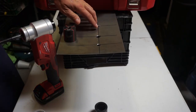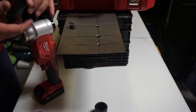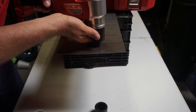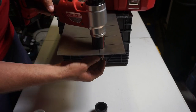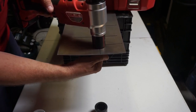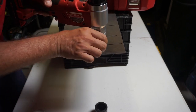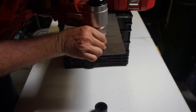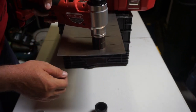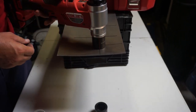I've got my metal already prepped and laid out, with some pilot holes already drilled out up to the half inch — just to show you guys how quick and easy this is. Come in here, screw the die on, line up your lines on the sleeve. They did an excellent job of making them pretty pronounced so you can square up your holes. And pull the trigger.